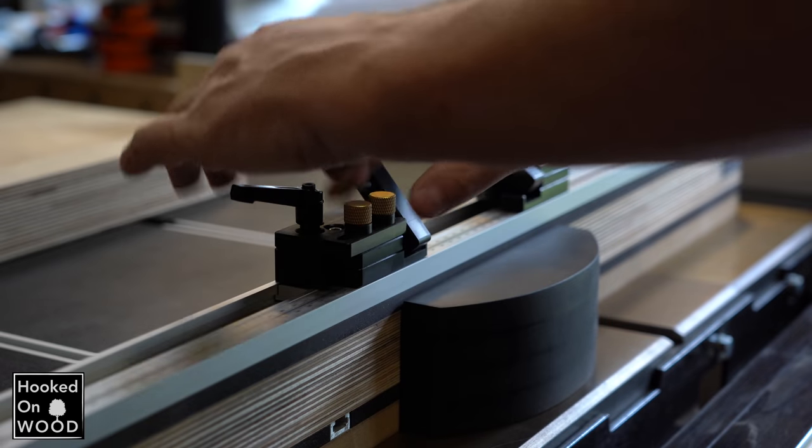The last clamp I want to mention is my favourite, and when you buy it as a set, it is very attractive from a price point of view. It has a straightforward design, and because it does not have a spring, it works the fastest. You can tighten the screw very easily and then tighten the workpiece. Its reach is about 55 mm, but it handles this with ease. Its clamping force is a bit limited — it is easier to get more force with other clamps. But 35 kg of pressure seems enough to hold down most workpieces. On my drill press platform, I think this one is the best choice in combination with the former clamp. It also comes delivered with another screw that you can use in the smaller T-tracks. I like its simplicity, and because of the smaller screw, it also has the flexibility to use it in different places.